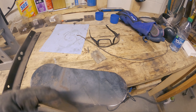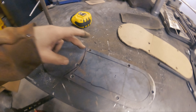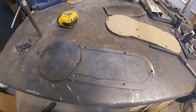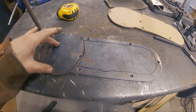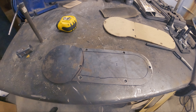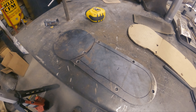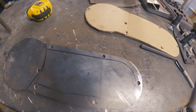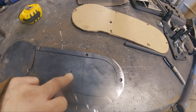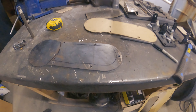I'm going to line it up with the cardboard template so I can get the holes and start drilling those out, and we can get things set into the dashboard. I've got everything to fit in the dash the best that I can. I had thought about whether I should cut these in half to be more flush, but I don't think that's going to happen — the nature of having a flat piece of metal versus gauges designed to bump out a little bit to go into that bezel means I'm never going to get around it. There's a little gap, not a big deal. I want to get the holes drilled for our gauges — I've marked off the center one, then I'll do the other two, get it back in the dashboard, and that'll be a pretty big accomplishment.